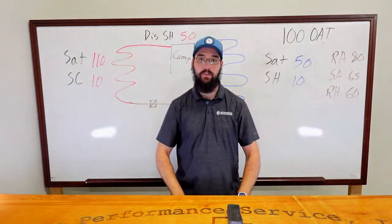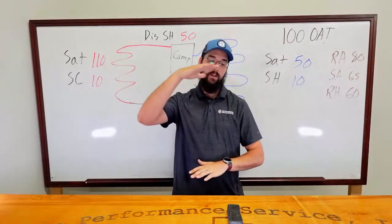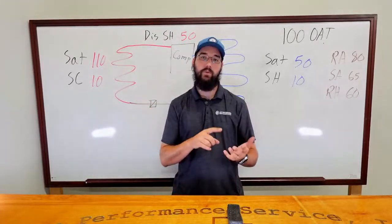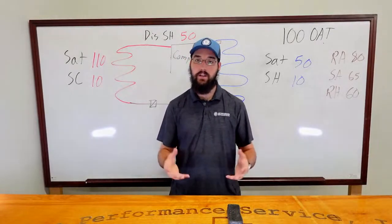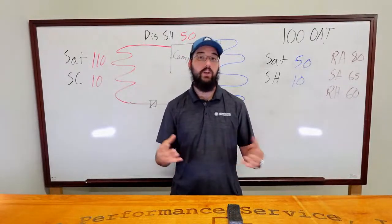And then underneath the whole assembly, the blower and coil section sit on top of another platform, and that lower platform is where your condenser, your water-cooled condensers, and compressors are. So it's not a heat pump or anything of that nature. It doesn't have reverse flow, and these are very large systems.